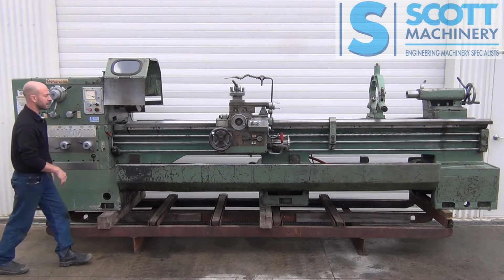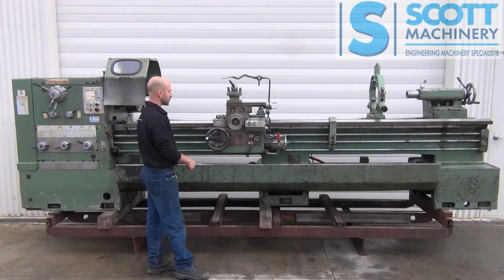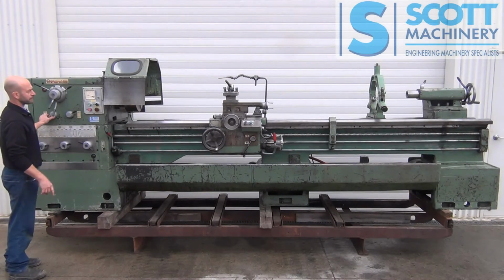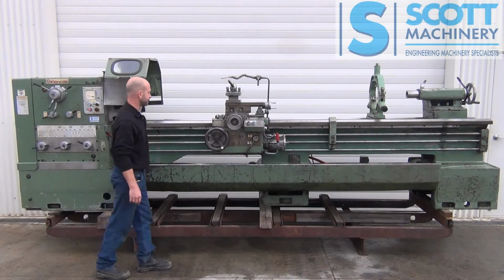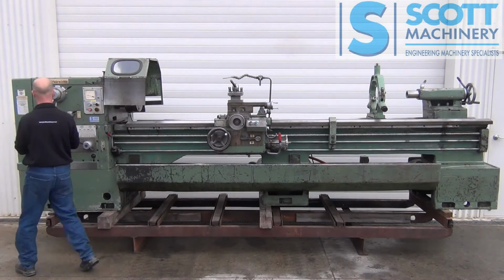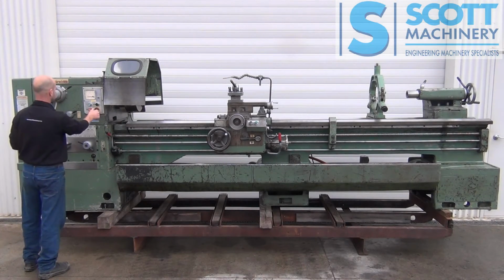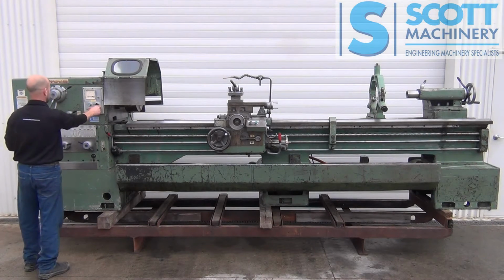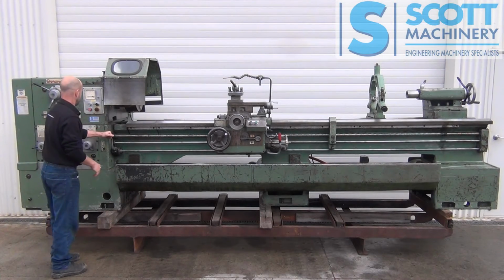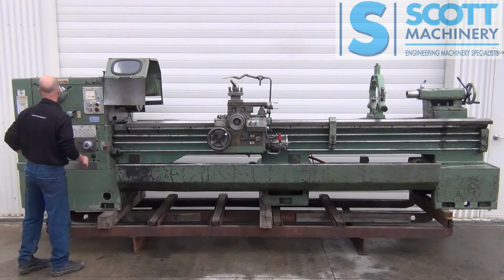You've got your direction here. I'll engage that lead screw. So that's coming towards me on the carriage, and I'll reverse that direction, and now it's heading away. So that lead screw was nice to engage. Put those feeds into neutral. Whoopsie, I've stopped it. Got it in gear. I'll push the emergency stop. So those are the feeds.